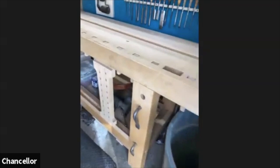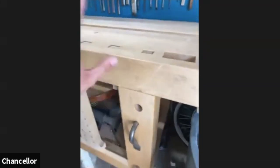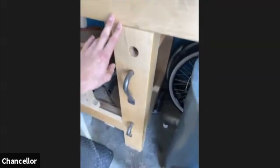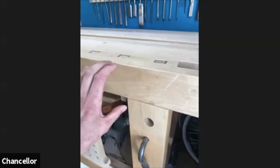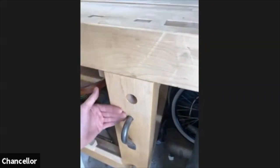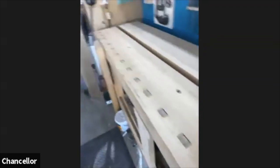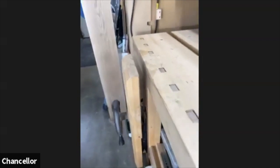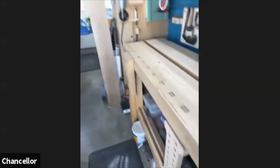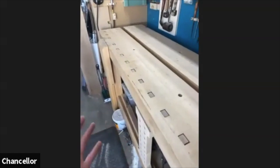If you're thinking about building a big bench there's a lot of expense in lumber, so LVL is a good option. One feature I highly recommend: my favorite feature of this bench is that the front face is absolutely parallel and flush with the legs. A lot of benches have an overhang where the top overhangs the legs — that's not useful. With the front being flush with the legs, I can clamp pieces directly to it, and the vise is flush too, so when clamping a long board everything is just flush with the table.